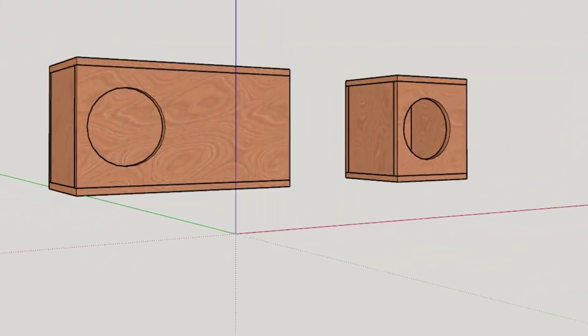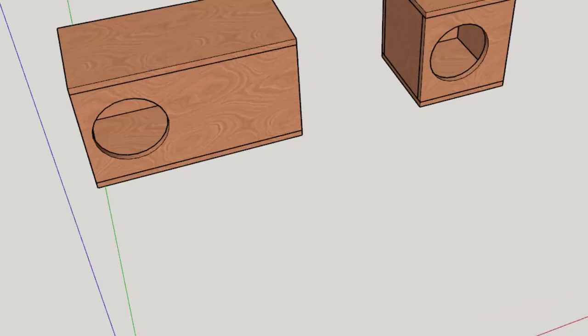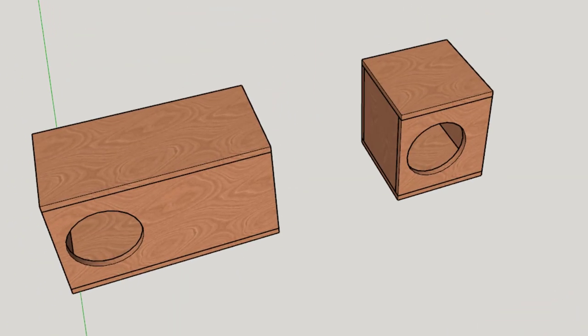It's simple and brilliant. To make the pneumatic spring tighter, you just make the box smaller. And to make it looser, you just make the box larger. When you have a smaller box with that very tight air spring, it makes it more difficult to move the cone. So you do need more power to move the cone, but you also get more control over the cone.